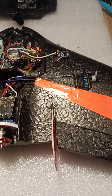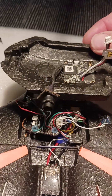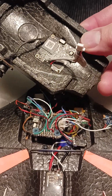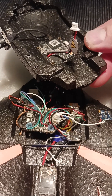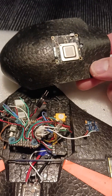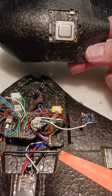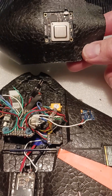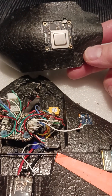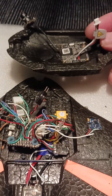Next is mounting the camera to the upper inside of the canopy. There are already magnets on it, and I've got it relieved for the spar in the back because this thing needs a spar. Then I have a round circle of screen that's going to go on top to make it look better and provide cooling. It'll be glued into the top — it's press fit but needs something to keep it from shifting, so I'll probably put some glue in each corner where the screw holes go.